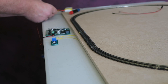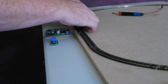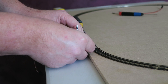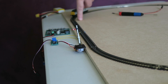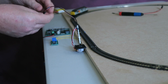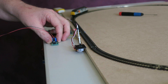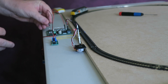Let's connect my power source. We'll need a loco, and I'll need a semaphore. What I have here is a modified DAPOL semaphore. I'll drop this at the start of the block. The actual block limits are from here to here — that's this one section — so if a loco is in this block then it should pick up and the semaphore should move. I'm going to plug the semaphore into servo position number one, and I'm going to take the cable and plug it into the block detector, with the red lead onto input number one of the servo controller and the black to the switch common.